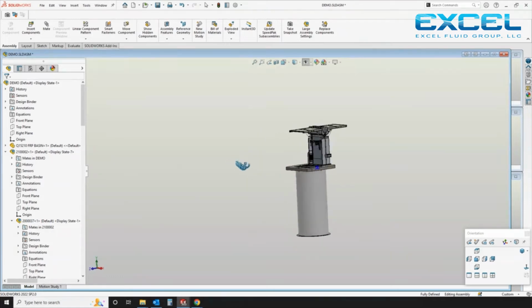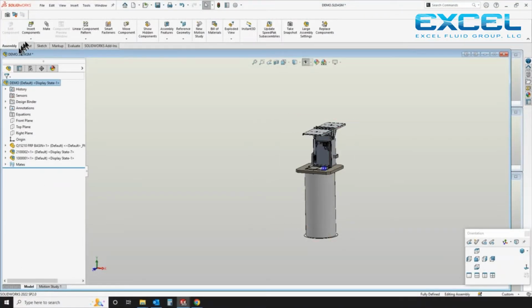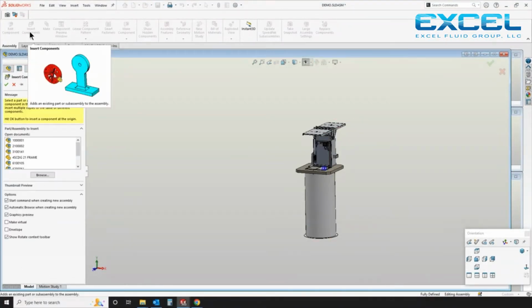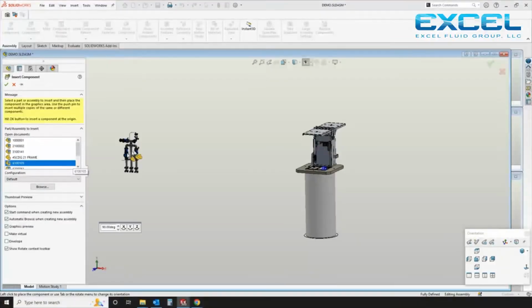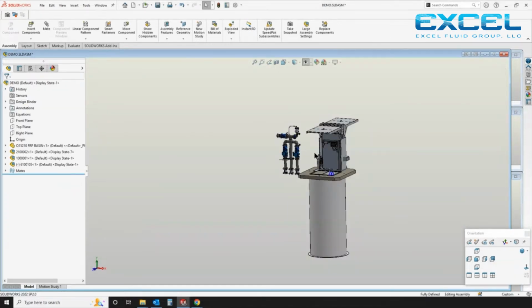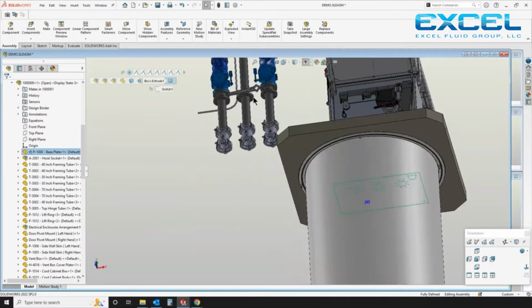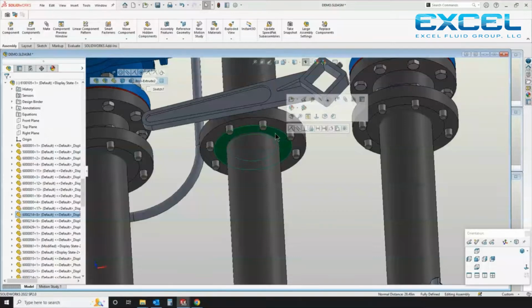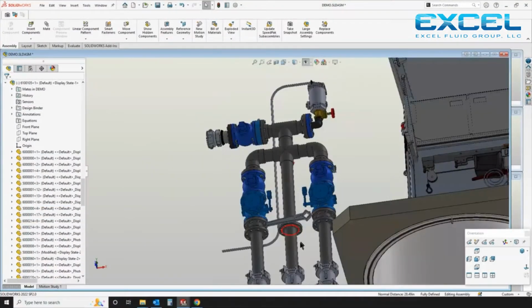That's our electrical side. This is our piping side, which you can't see the piping yet because that's not there. But we do have the lighting already pre-installed in this building, as well as the pump lifting hoist. And this is a PVC 4-inch pipe header with ductile iron check valve and plug valve.